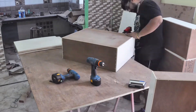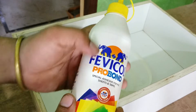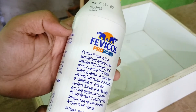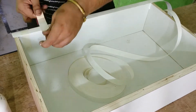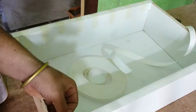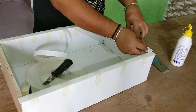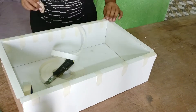Then I install the edge banding onto the drawer sides. I'm using glue-on edge banding rather than iron-on because iron-on wasn't available here. To glue this edge banding I use a special adhesive that dries quite fast and makes a tight bond instantly, so there's no need to apply additional force. But if your edges are uneven you might need to use paint tape to apply adequate pressure.